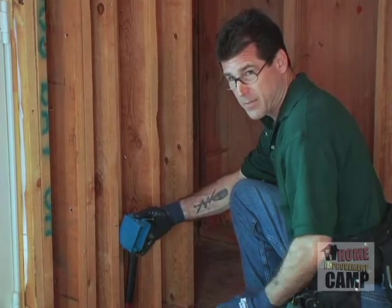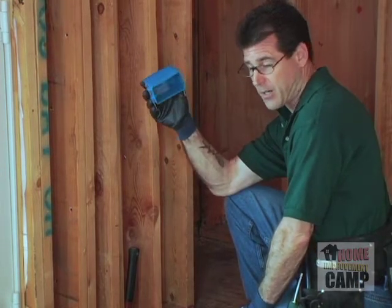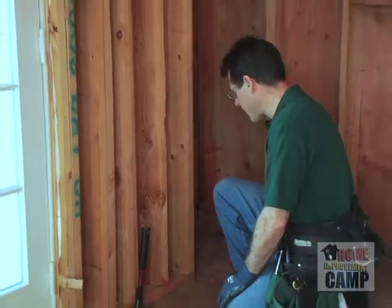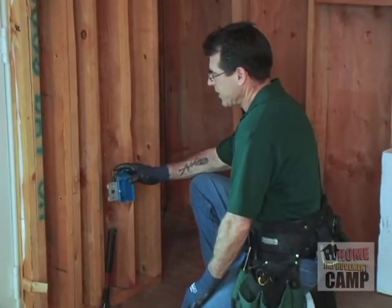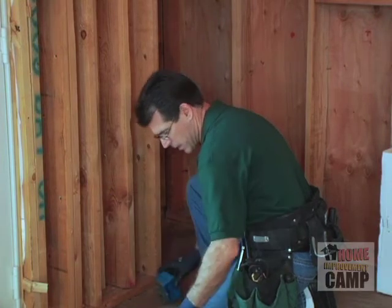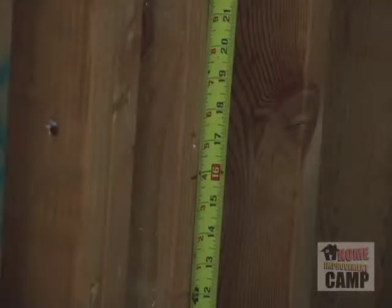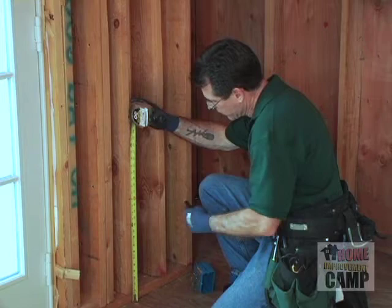Plaster veneer walls in this case. So I'm not going to use this nail-it box, because here there's just going to be too much adjustment. It'll be a lot safer, a lot better if we use the adjust-a-box. That way, if they go 1/8 of an inch veneer, 1/4 of an inch veneer, or if this particular spot's a little higher or lower, they can adjust the box to whatever level they want. But I am going to increase my height a little bit to go for flooring. I'm going to go to 17 inches to the top of the box, and that'll give us 1 inch for flooring.